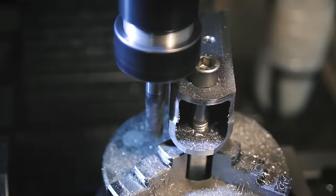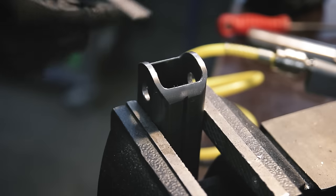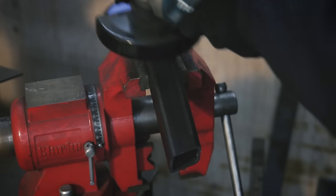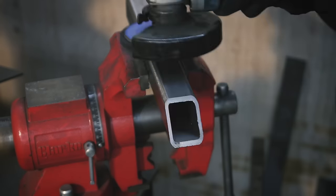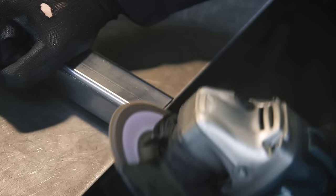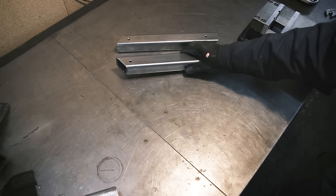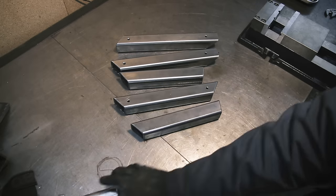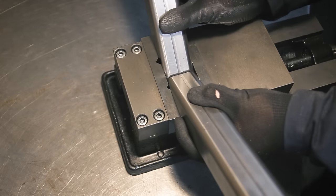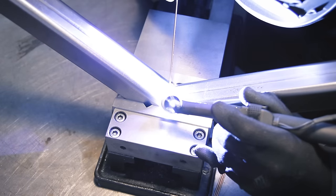I'm doing some roundovers on the mill, which is super inconvenient, especially with these hollow parts, but it somehow worked out. I often don't bother doing this, but this time I actually did some actual prep work and took off all the mill scale and chamfered all the edges on the tubing in order to get some decent weld penetration. If the parts aren't too big, I like to tack-weld this kind of stuff in a vise, because it keeps down the distortion and makes sure everything is straight and parallel.